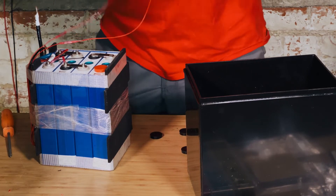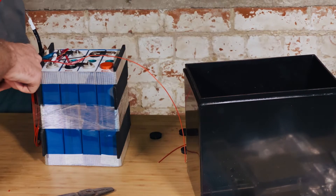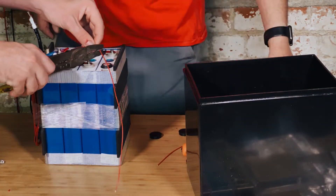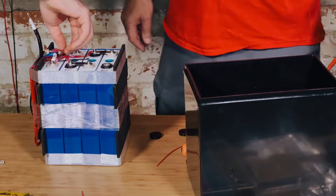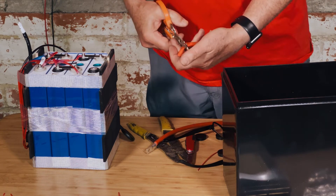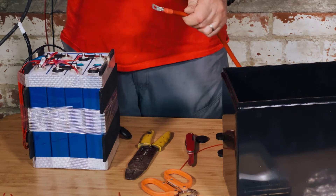It really makes no difference, especially if you're only cutting a couple of inches. We had to extend a couple of leads actually, because they didn't quite reach from the bottom of the BMS to the end of the cell. These Daly 100 amp BMSs come with fairly short balance leads, so just bear in mind you may need to extend them. We then started measuring out for the main red wire. We quite like this battery case because the positive and negative are on either end of the case, which keeps them apart and reduces the risk of shorts.